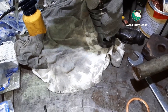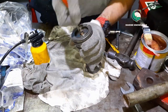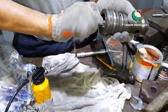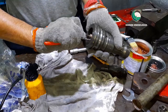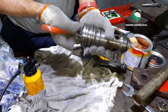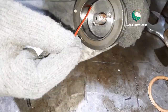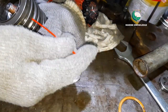Press the piston against the spring and tighten it with the valve. You can use a nose plier for this, as the special tool may not always be available on board — sometimes you need a makeshift arrangement. Once tightened, check the surface: there will be a marking, and the hole up to that marking should be free. This hole is for pilot air to enter.